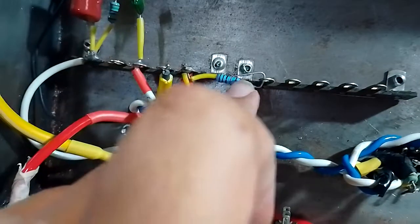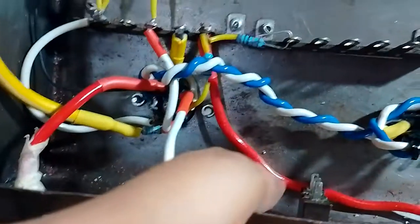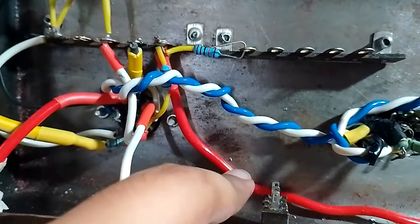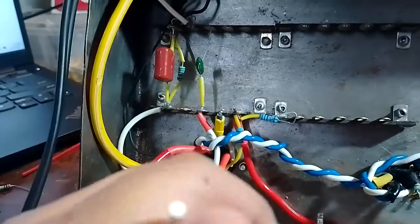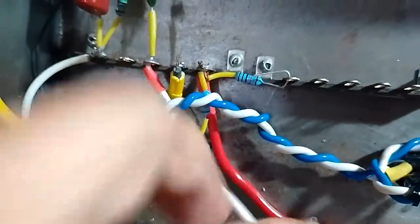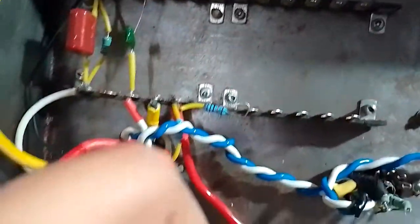This resistor is for the next stage. I haven't wired it in yet, but it's just over there now. This goes to B+, which is supposed to be 233 volts. It's a little high now, but I'll see what we can do about that. And I have also connected the leads that I'll be needing for the next stage now, because the tube socket was getting congested, so I wanted to do these now because it would be a mess to get in and try to do them later.